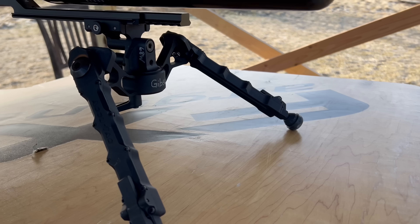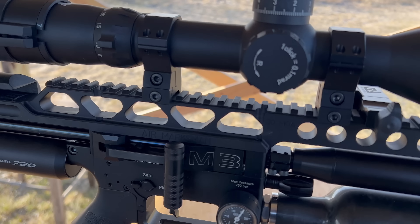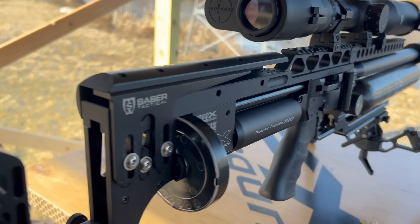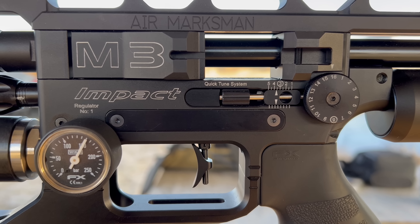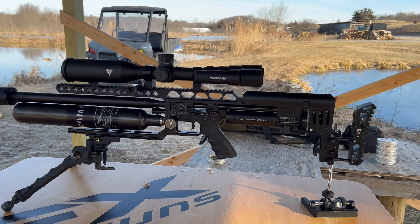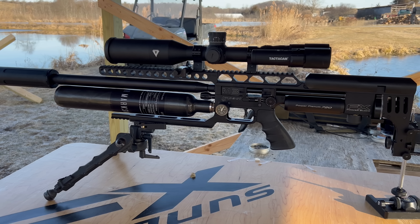The Accutac Benchrest model, the Saber Tactical bottom rail, a Ronin Donnie FL, and the Valdata on top. The Valdata was my choice for bench because I've got all the way up to 28 magnification — it makes a huge difference for seeing the holes in the paper. The hammer settings are right there so you can copy that if you like. The first reg is set at 150 bar, and the second reg, the final reg right there, is exactly 100 bar. It's a really calm tune that lets the gun recoil and be happy. If you can hear the gun going off in the video, there's just a calmness about it.